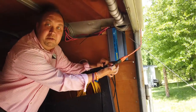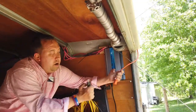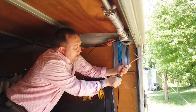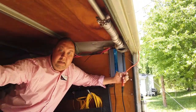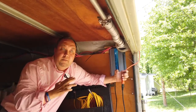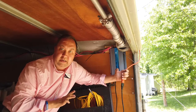This is the reverse plug — sometimes people call this a suicide plug — because it's got the two wires coming out with power. The way this DC inverter works is: if I unplug it, it goes into a mode where it's not seeing AC current from the grid, and it turns itself off so it is not live and you can't get shocked. But as soon as I plug it back in, it says 'I see power coming from the grid, I can now send my 400 watts into the grid.' It's a safety mechanism so that if the power goes out, line workers don't get electrocuted. This only works if you have grid power — it is not intended for an off-grid situation.